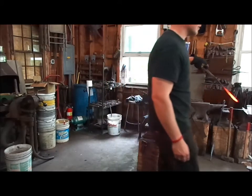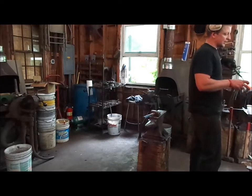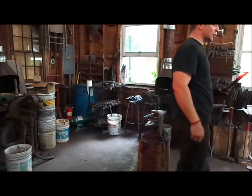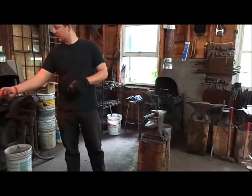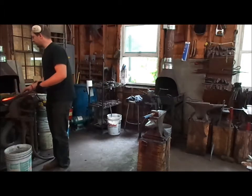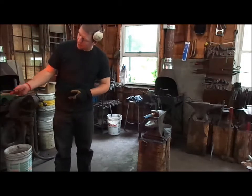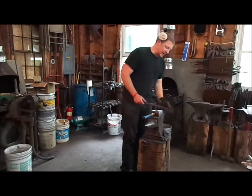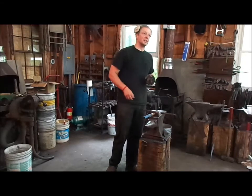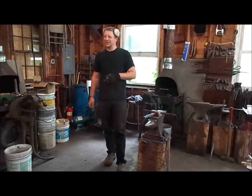You can see the side is all just flaking out, and that is where the impurities in the material have rendered it essentially unworkable. This bar I forged out — this was the top center of the ingot, and I've already trimmed some material off it, but it's still giving us trouble. Forge welding doesn't generally work well with wootz. You can forge weld wootz, but you run into this problem where the hotter you get, the more likely it is to crumble. With forge welding you want to get as hot as possible, so there's a very narrow range where you're hot enough to forge weld but not so hot that the material just crumbles. You can make your problems worse very quickly.